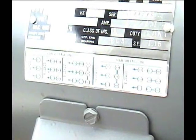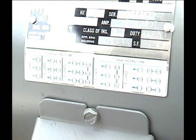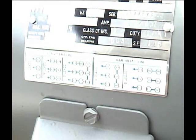There's the label on the motor. On the right-hand side is the high voltage hookup — you'd normally hook it up to a 460-volt feed, but actually you're going to be running this on 120, while still hooking it up to the 460-volt high voltage circuit.